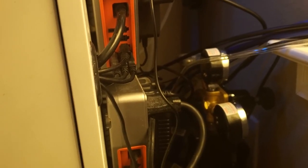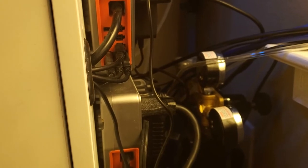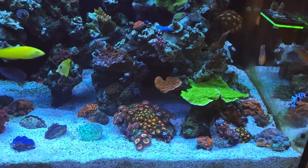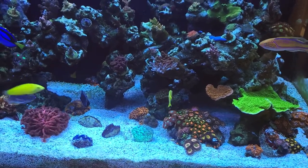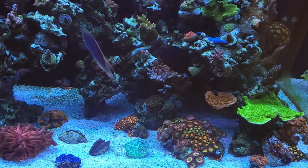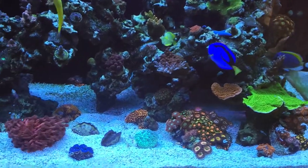Just look up the acronym. The way it works is there's a do-nothing time, and then you set another time which is the run time. For me, I started at about 15 seconds. So that pump is going to run for 15 seconds, and then I have it set to 200 minutes off. So every 200 minutes it'll wait, then run for 15 seconds, and wait another 200 minutes. That's how I have my setup.